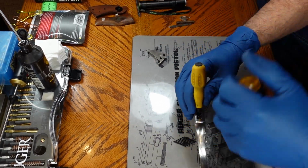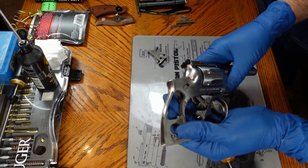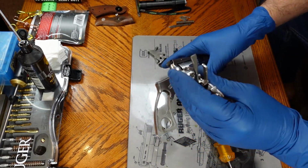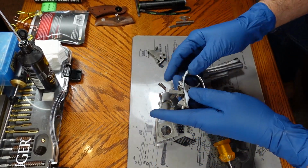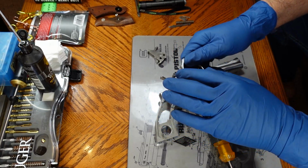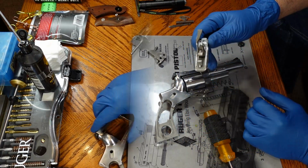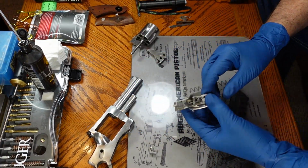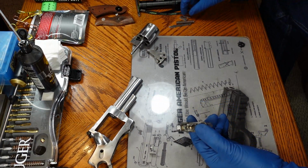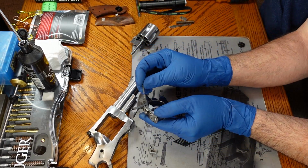All right, once it's depressed, we're just going to give this little screwdriver in the front a little pop. Okay, and when that happens, the whole trigger assembly, the transfer bar, and the advancing dog, or push paw, for the cylinder is all going to come out together with that trigger part. Okay, there is a pin that goes straight through the trigger itself, and that's right here.